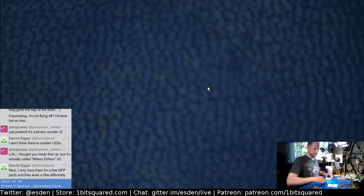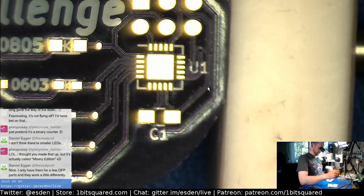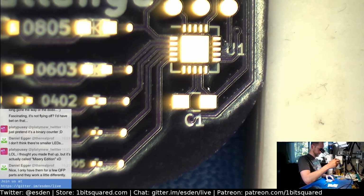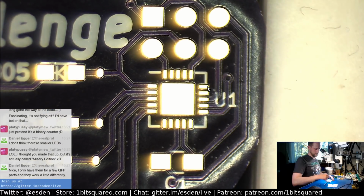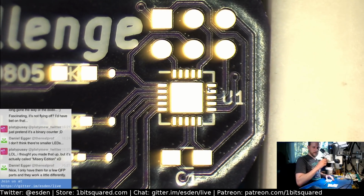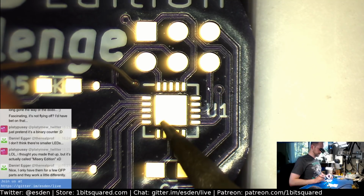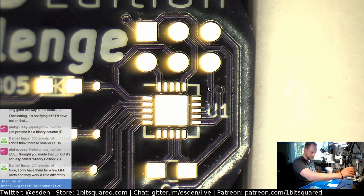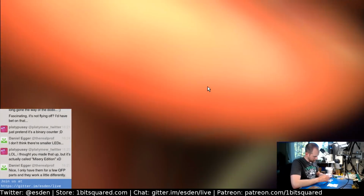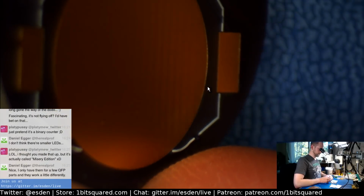Okay, so let's wet those pads. Oh yeah, too high, I can't see anything. Okay. Is it focused? I'm sorry, it's not very focus friendly. Okay. There you go. I could theoretically just connect the outer ones, huh? Just solder the outside. I have the feeling the ground pad on this one is not even connected. Yeah, it's not connected.